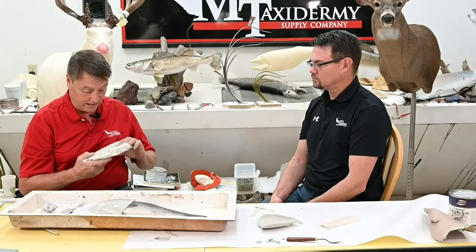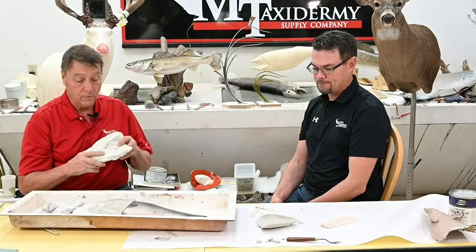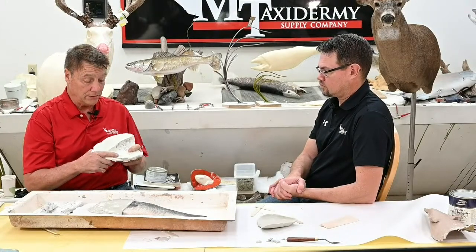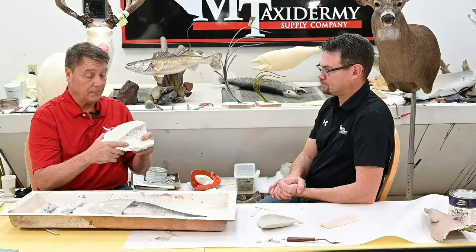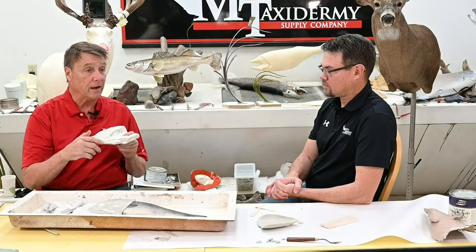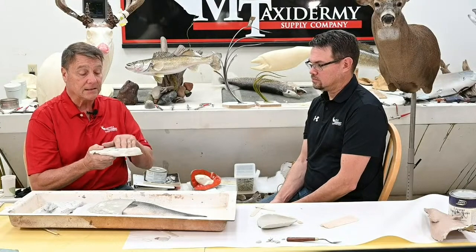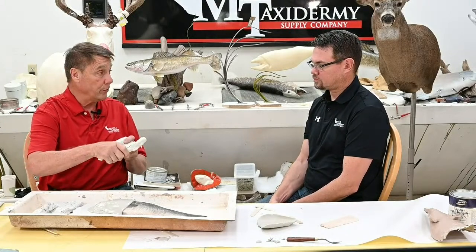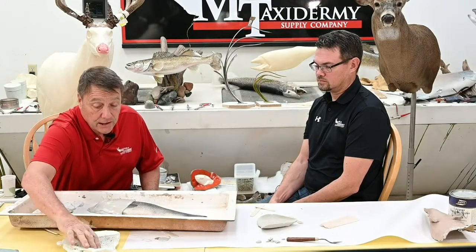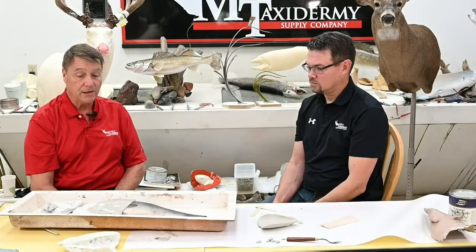This still has your polyvinyl alcohol on it, a nice coat of it. We could make more. So we've shown you two different methods of making rigid molds. This is plaster, and watch last week how we took the fish and washed him with aluminum sulfate to close up the pores. We got all the slime off, because slime reacts with plaster and will ruin your finish. You go to all this trouble and the inside surface would be ruined. Plaster is a good, inexpensive method. You can easily make small fish out of plaster.